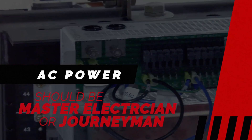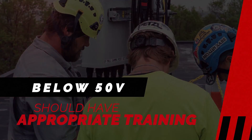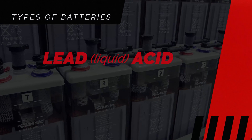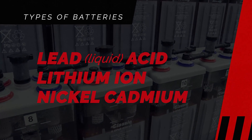Okay, Corey, next topic — batteries. Handling DC power is way different than handling AC power, right? Well, to handle AC power, you have to be a master electrician or a journeyman electrician in most cases. There are situations where you can be a qualified electrical employee. To handle anything below 50 volts of nominal voltage per OSHA, you don't have to be a qualified electrical employee, but it is important that your company offers you training on how to perform that type of work correctly. When you're working near batteries, you always need to understand that there are several different types of cells out there — liquid acid battery cells, lithium ion batteries, or nickel cadmium batteries — all of which have different rules for cleanup and PPE protection.